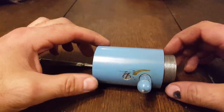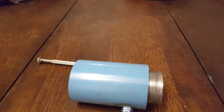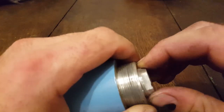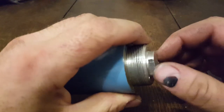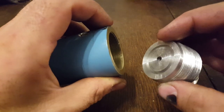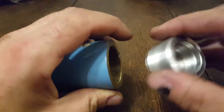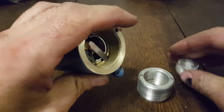Same idea — square hole, round hole. There's a cap that goes on here, and this is it; it normally screws in here. It's replacing the actual primer and detonator assembly. You can see the hole — this part actually plays a part in the fuse, and that hole is where your firing pin is going to hit the primer, which would then ignite the rest of the parts.